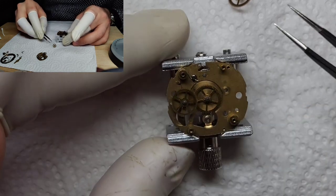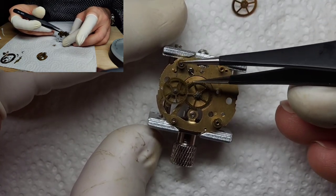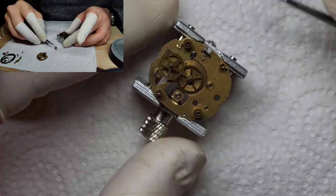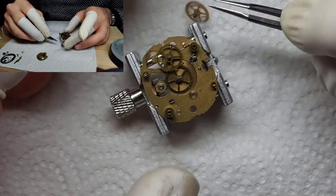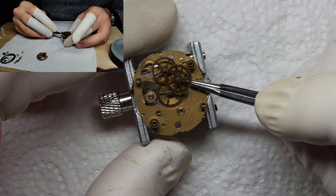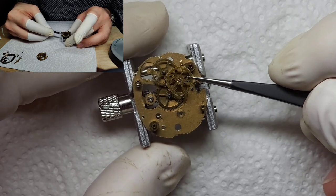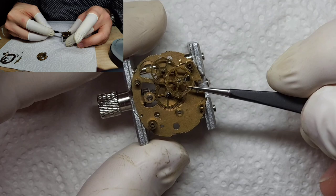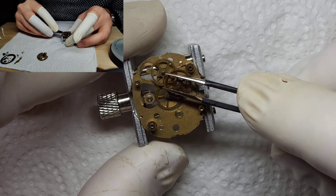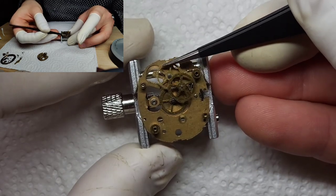This is tight - very tight indeed - and it's all brass on brass. So when it says on the case that it's shockproof, quite what's shockproof about it God only knows. Surprisingly, all the tolerances are still quite good being brass on brass. You can see just where those two wheels meet there is that tiny little hole, and that's where we've got to try and get this wheel in. It's hard, very hard. I'm just trying to get the bottom somewhere near, not bothered about alignment just yet - I just want to get it near and fettle from there. And I think that's just about in.